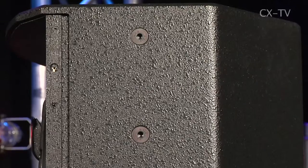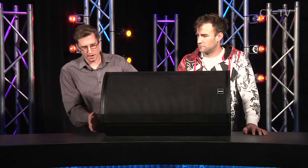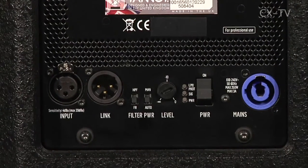There are various M10 bolt points and a section where you can remove and fit a top hat adapter, giving a variety of mounting options. Tannoy wanted a variety of application uses — the market is flooded with black boxes, so you need a point of difference. They've included plenty of rigging points: M10 points for flying, yoke brackets, and in a low-ceiling application you could fly it in a horizontal orientation too.